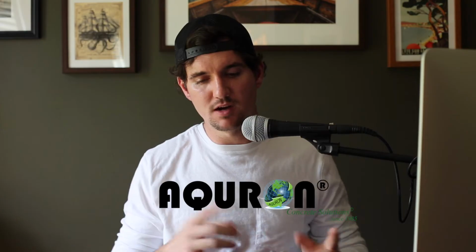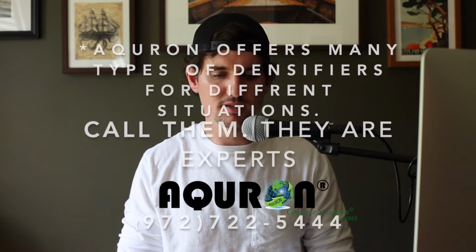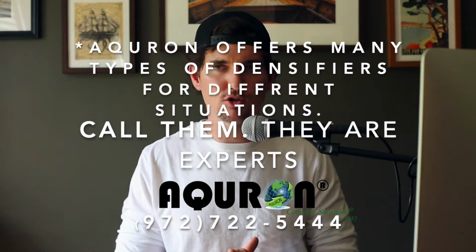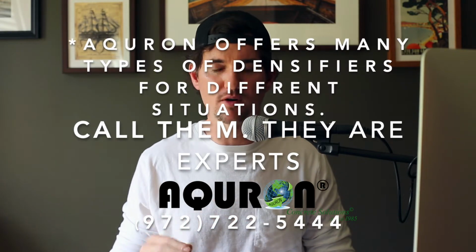So get yourself a good densifier. In that video, I talk about the best densifiers on the market. They're from AQURON Corporation. They're out of Austin, Texas. Okay. So it's going to petrify the concrete, make it much stronger, waterproof it, and it's going to skyrocket the adhesion of our coating. It's a phenomenal primer for our coating.